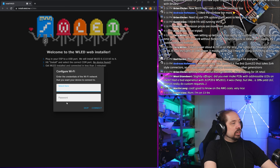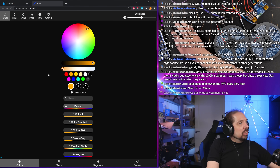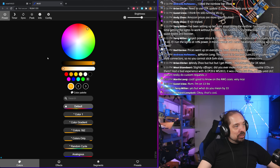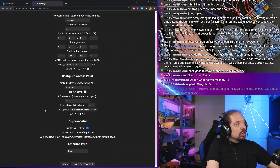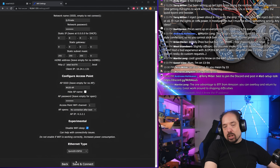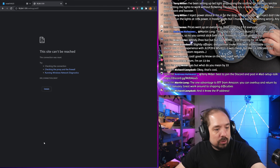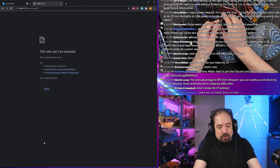It's asking me to configure a network. So we're now connected to WLED over Wi-Fi, but we want to use it over Ethernet because we have this Ethernet port. So we go to Configure, then Wi-Fi setup. Down here, we select Ethernet type and select the QuinnLED ESP32. Hit save and connect — that'll enable the Ethernet port. Of course, I also need an Ethernet cable, so let's do that.